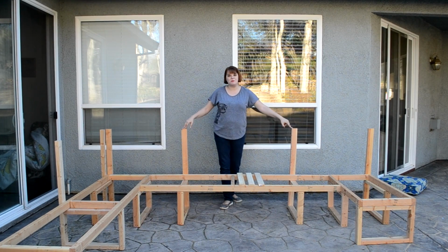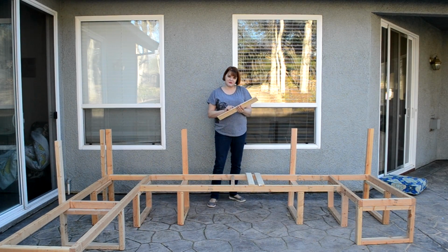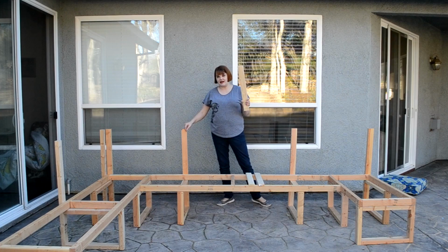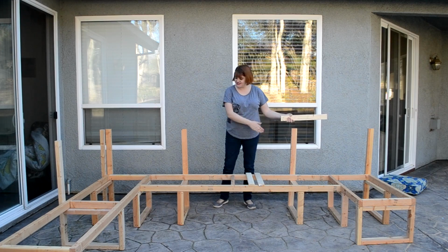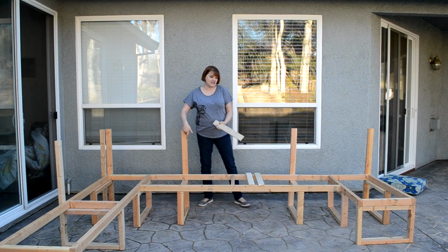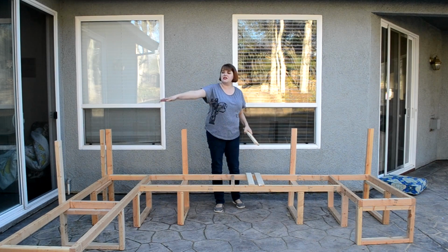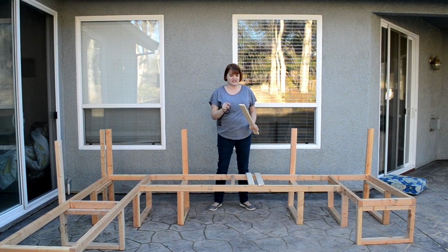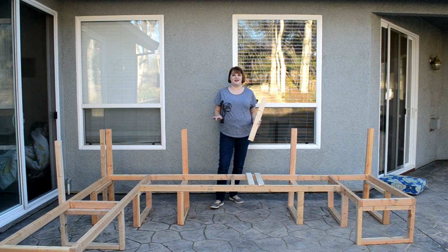Now to make the back, I'm going to do something similar, except I'll be using longer slats. I'll be taking this same kind of wood, but running it all the way down to here. Now I got these in 8-foot strips, which is shorter than my sectional. So I had to cut them to 87 inches to get right here so that I can screw it into the back of this post and that post, and then 37 inches to finish off the back, and then 84 inches to do the other side. Those were my measurements. Remember, you're gonna have to measure everything yourself based on the cushions that you are using. So don't get too comfortable with the numbers I'm tossing out here.